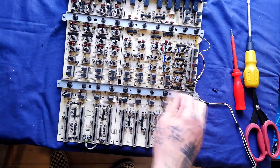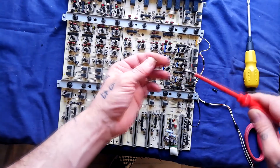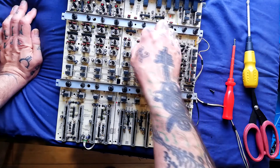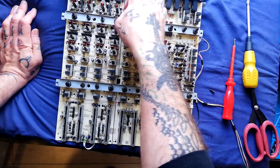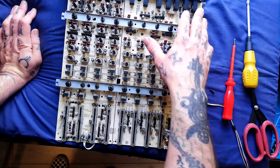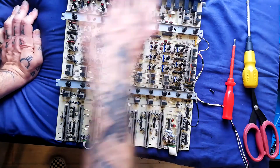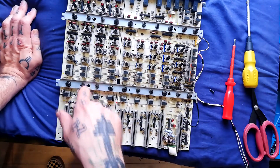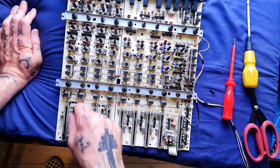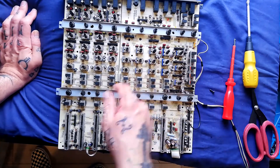Now that shielding's going to come off. You can see this foam is kind of crumbling — it's still doing a job of stopping dust getting in, but crumbly material like that is actually worse for getting into your faders than the dust itself. Rubber or fabric, which are the materials I've seen used in Tascam units, would be a better choice. This is foam that deteriorates with age — that's foam rot — so that's not good. I'll scrape most of that off. Most of the debris on these faders is foam that was meant to protect them rather than dust itself, though there is a fair amount of dust in there too — it's pretty manky.